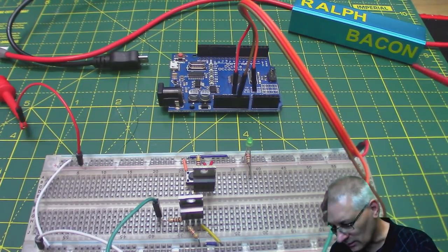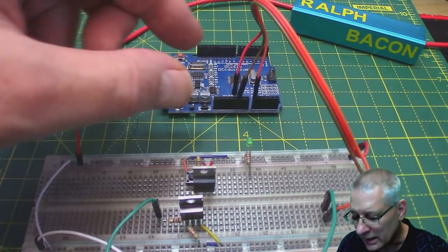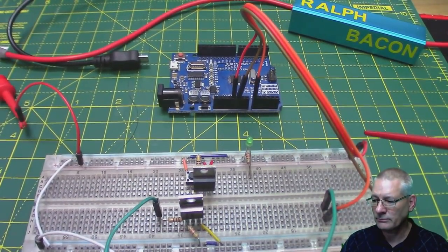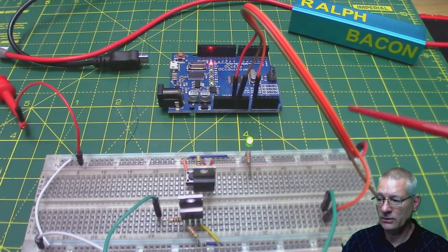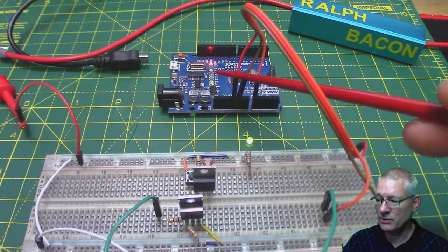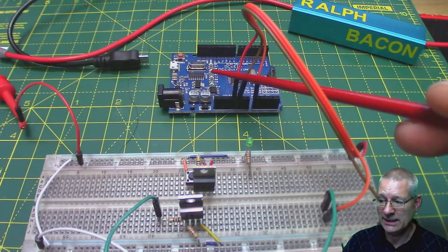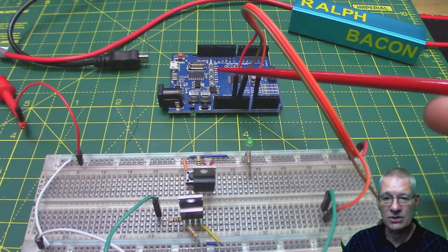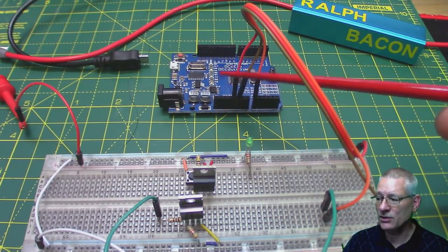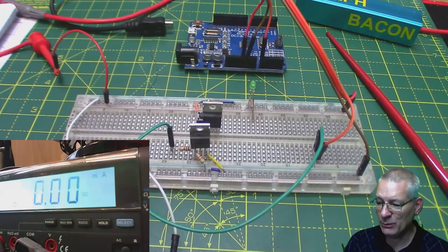It's currently powered up and as you can see nothing's on. I've got this connected to the power supply. The Arduino is dead, but if I push this little button here — which is hidden behind the MOSFET — that's connecting the gate to ground. On it goes. I let go. That was too quick — you can see it started to fire up and then cut out again. That's because I've got the USB connector connected to my hub, so as the Arduino fires up the USB-to-serial converter kicks in and the bootloader checks if there's a sketch to download.